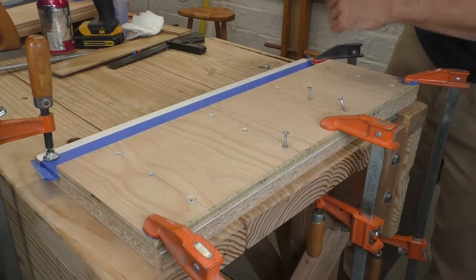Screw your fence down so that it overhangs just a bit, and then shoot it even with the fixed fence. Now you can test your shooting board with any random plank of wood, as long as it has one straight edge to sit against the fence. I got lucky, and my shooting board produces a perfect 90-degree angle already. But if yours is a little bit off, it's no problem — this is why the second fence is adjustable. You can loosen your screws and shim the adjustable fence with a bit of paper or a plane shaving to get that perfect 90-degree angle. As your fence inevitably gets chewed up from shooting, you can just slide it out over the track and shoot it square again. And if your fence ever needs to be replaced, you can make a new one without making any changes to the rest of the board. For instance, I forgot to chamfer the bottom edge of my fence — you need a place for dust to go, just like we did with the edge of the plywood. Adding that detail is easy, and I don't have to change anything else.